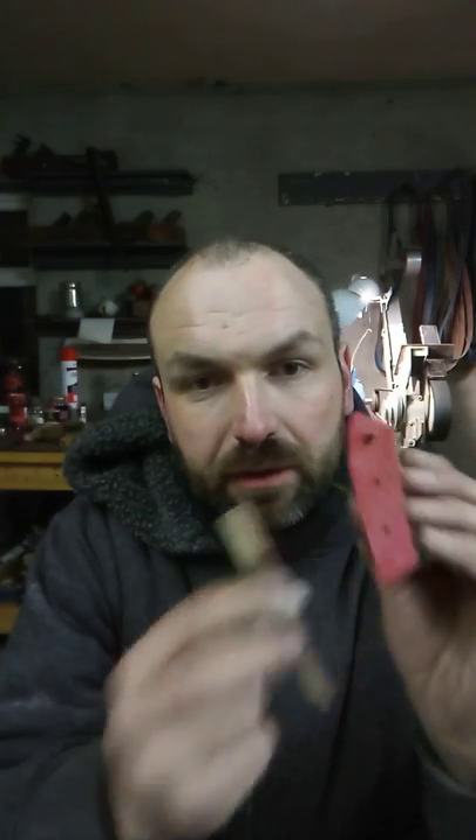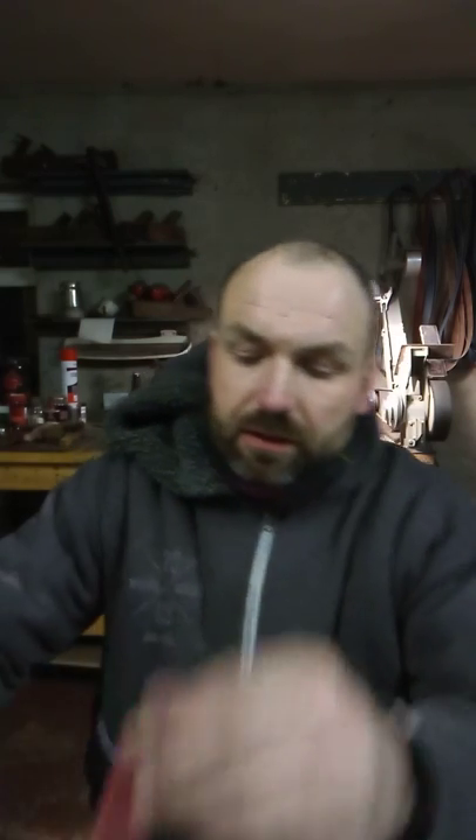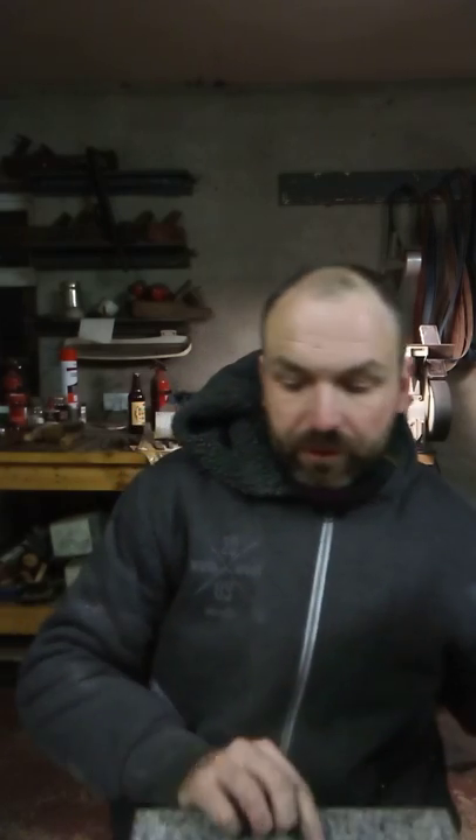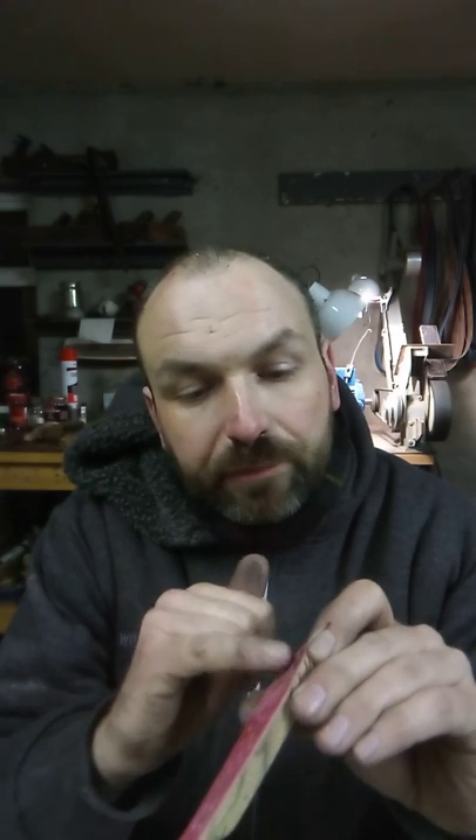So here you can see one I've polished up and one I haven't done quite yet. You can see the rough jagged edges around the drill holes from the burring. This is where wet-and-dry paper comes in — just a matter of getting it nice and flat, making sure those rough edges around the holes are taken down, removing any ridges, anything that's not perfectly flat. You want as flat a surface as you can get for a nice flush finish between scale and steel.